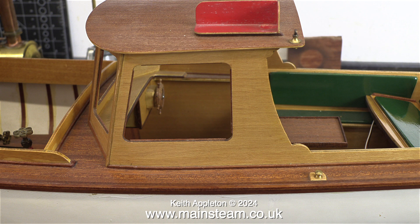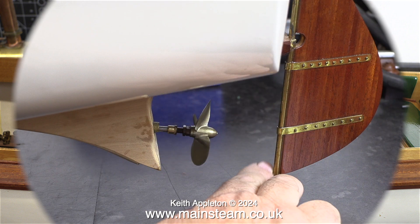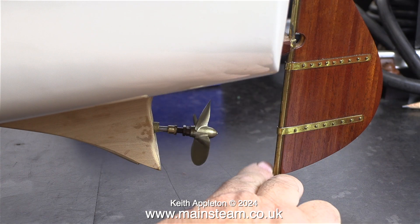Time to look at just some of the problems with it. For me the brief is to make the steam plant work, not rebuild the boat, and I've priced the job accordingly. The prop shaft is seized in the bushes, and when I tried to pull the prop shaft out the bush came out as well. This wooden part underneath the boat definitely needs painting, and there isn't a part known as a skeg which supports the rudder.